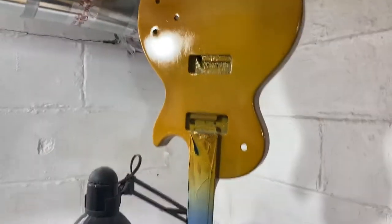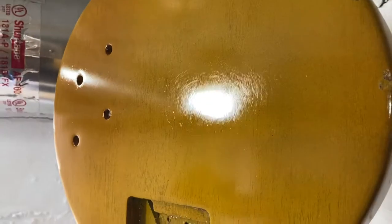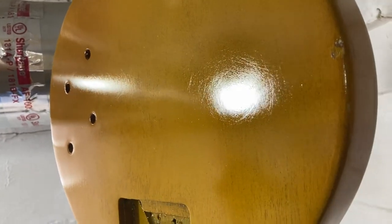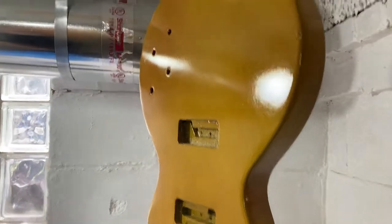We also have to be careful to leave the serial number when painting so you can't get a bunch of paint in there — it'll just flatten it out. But the good news is you can't even see where it was broken. And once a headstock repair is effected, the joint is usually much stronger than it was originally. What is this cool thing here? That's a '55 Les Paul Special that I'm rebuilding. It came to me with a big hole where somebody had inlaid a piece of brass thinking a bridge would sound better sunk in brass. I took the brass out, inlaid a piece of lumber that matched up the grain, and now I'm doing a relic paint job — it's going to look like somebody had kicked the crap out of it over the last 60 years, real dark shades where the ambers are like almost tobacco-y, cracked up.